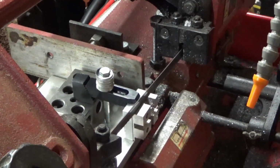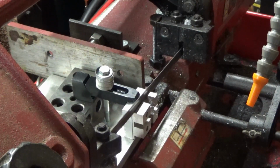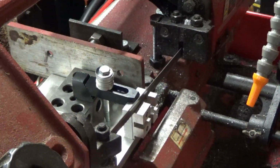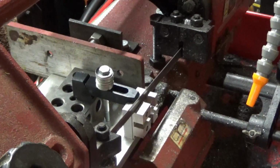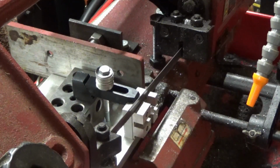Okay, as usual, changing plan again, back to the original approach. I couldn't use the slitting saw on the mill without adjusting the work piece anyway, because there wasn't enough clearance. Despite how much I would like to build another tool to make that clearance problem more minimal, I want to get this job done. So I've just lined it up in the bandsaw with the fixture plate, and I'll cut it off and then do the same steps I was going to do anyway, flip them over in the mill, and trim down this saw cut side until I've got the right thickness.